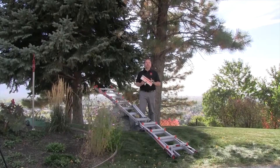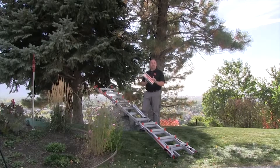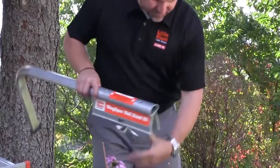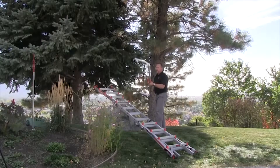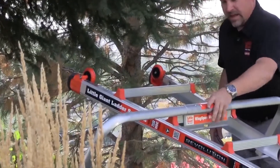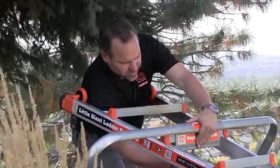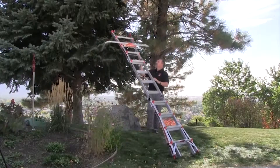If you purchased a Wingspan wall standoff with your Little Giant ladder, here's how to put it on. After extending the ladder in the extension ladder position, assemble the wingspan — the arms simply slide into the housing and a spring-loaded button pops into place. Do the other side the same way. It's designed to go on one of the top two rungs of the extension ladder. Place it in the middle of that rung and clamp the butterfly nut into place. The wingspan will stand you away from a window, eave, or overhang — you'll never lean your Little Giant ladder against the gutters again.